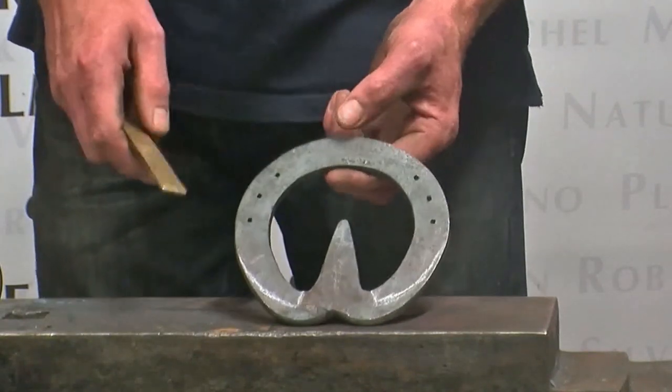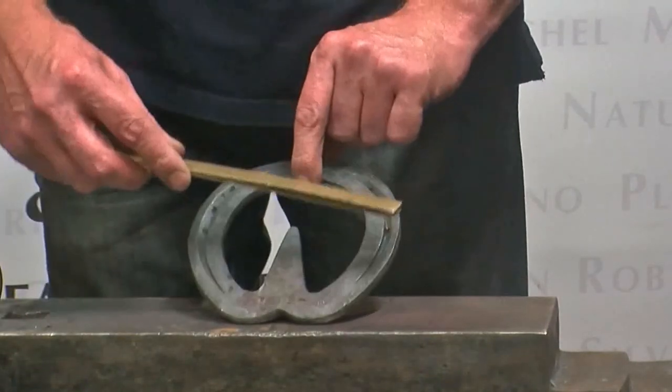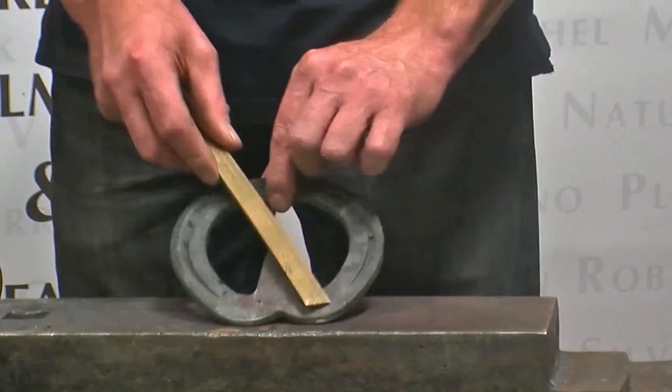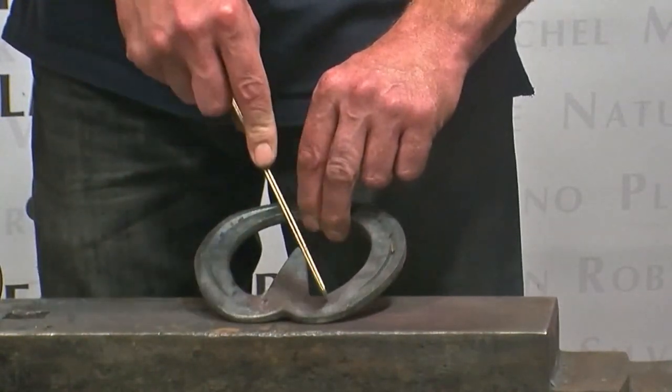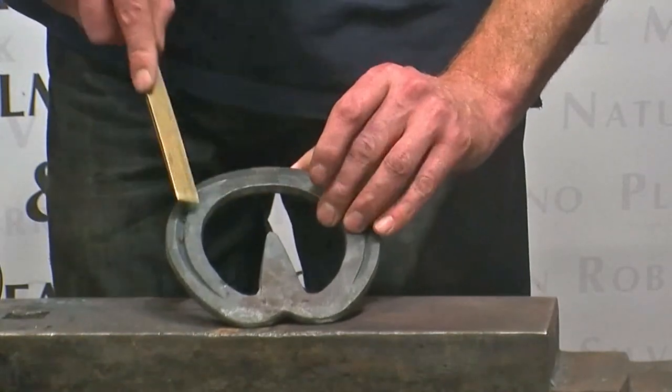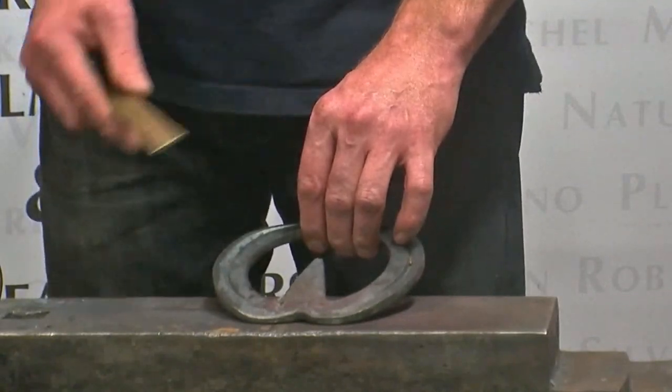So to make a bar shoe for this foot, I have to cut 18 inches. So just a quick breakdown: width plus the length of the frog plate, plus 1/2 inch for that corner, plus 1/2 inch for that corner, plus 1 1/4 for the toe bend, plus the width of the section. Add all that up, that comes to 18 inches.